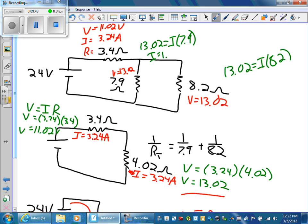1.34 amps. And the next one, I equals 1.5 approximately. 1.65. 1.6 approximately, okay, 1.6 amps. Once again, check out current divides, right? 1.34 plus 1.6 is getting you close back to, remember, this is math here, we're throwing away some significant digits, getting you close to your 3.2. Sum back up to the total.